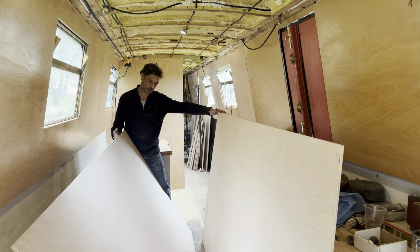So I need to mark out where all the curves are now, and then on that side I need to also route out that bottom channel so it hangs over the 15mm melamine. Alright, let's get the router. Right, it's all been trimmed. I now need to take out 2 pieces of that ply from there, just leaving 1. Right, I've routed that channel out now.